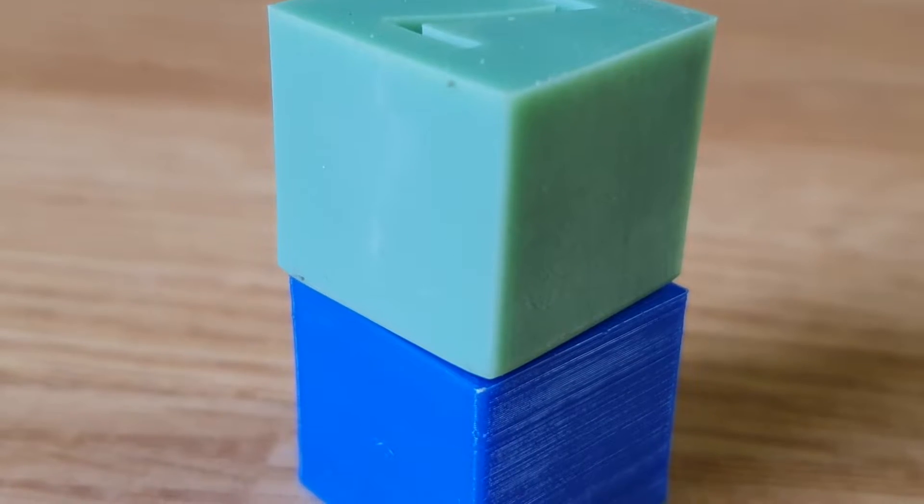The sides are very clean and clear. I took out the vernier and measured it: on one axis it's 20.2mm, on another it's 20.3mm, and on the third axis it's 20.1mm. So it's not 100% accurate — I have heard that achieving precise scale accuracy can be quite difficult. It's got a linear rail on the Z-axis, which keeps the Z very stable with no wobble. Absolutely amazed at the functionality of this printer, how well it prints and how clean and precise those prints are.